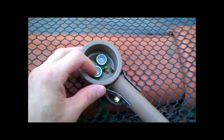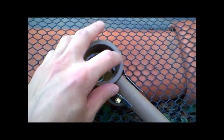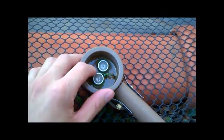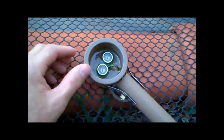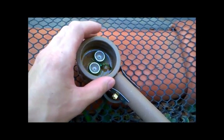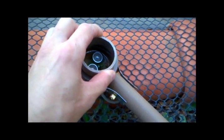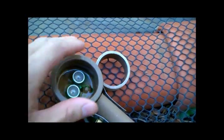This is the cheapest ultrasonic sensor that I have. I potted it with epoxy resin, so the epoxy will protect the electronics from water and humidity. Unfortunately, you cannot pot the receiver or the transmitter. This is a 50mm cap, so it's the base for the sensor. I also have a little piece of 50mm pipe that I will fit in here to provide a better water shield.